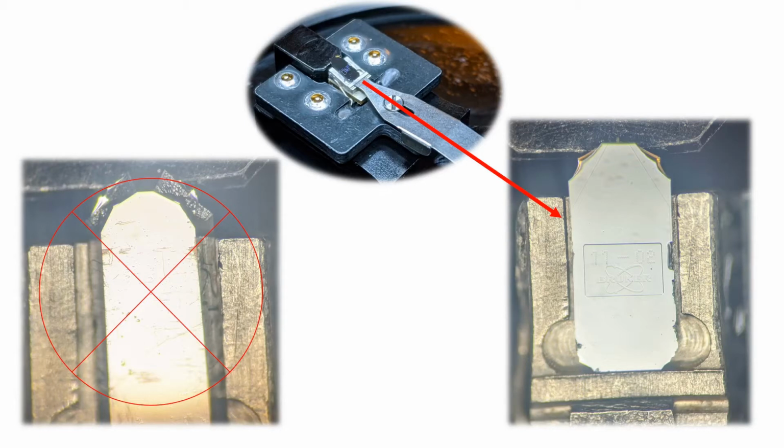The top center image shows an example of a probe which has been dropped onto the holder. Moving to the right, this is an example of how you should have the probe positioned on the holder. It needs to sit entirely flat in the recess. As a result, it's not a bad idea to blow any particles off of the holder before mounting a probe. You can do this with dry nitrogen mounted on the wall in the room.